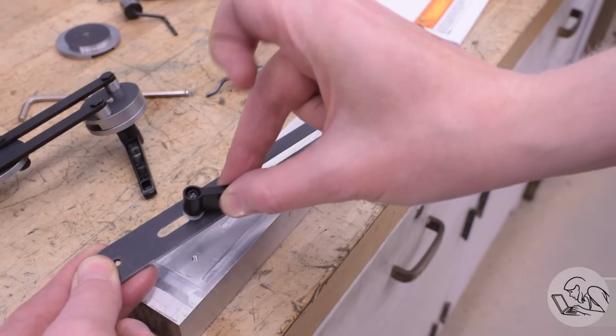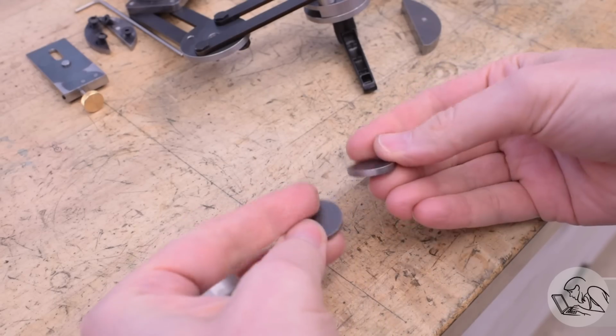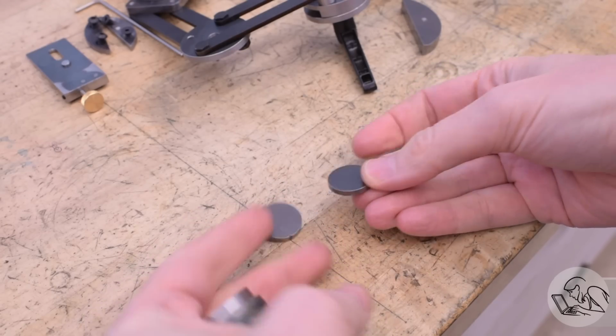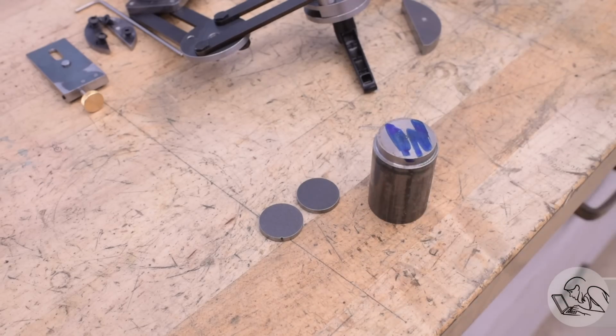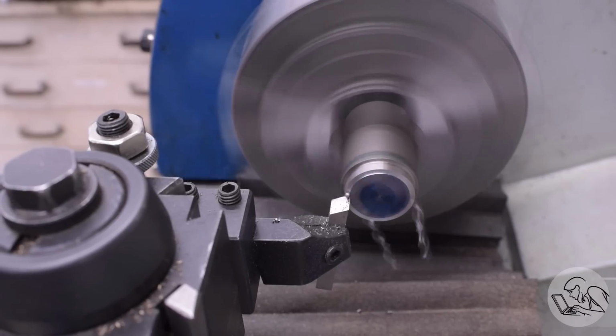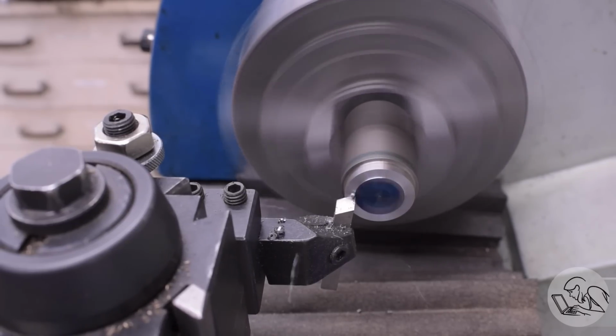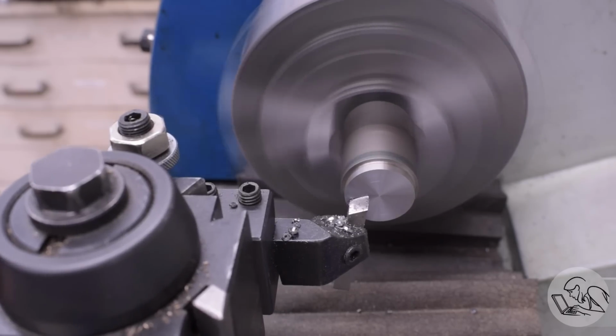Next up are a couple of large beveled washers, and the kit includes these fiddly little laser cut discs of hot rolled plate for the purpose. However, making beveled washers from those is a whole lot harder than just turning them out of some steel round bar. So that is what I'm going to do. I'll put those little discs, I guess, in my steel bin, and who knows, maybe I'll find a use for them someday. But for now, let's go straight to the round bar and turn these washers.